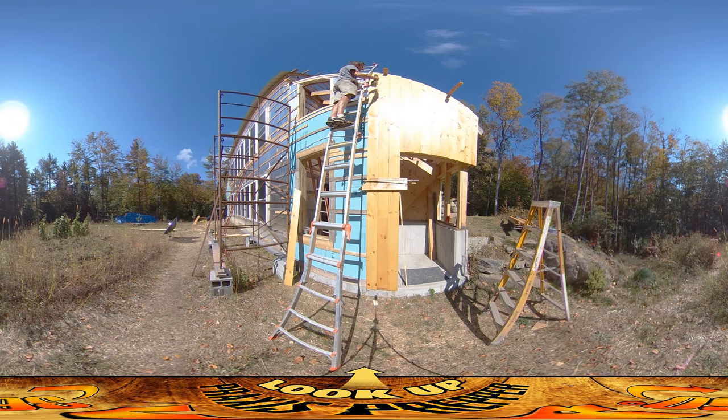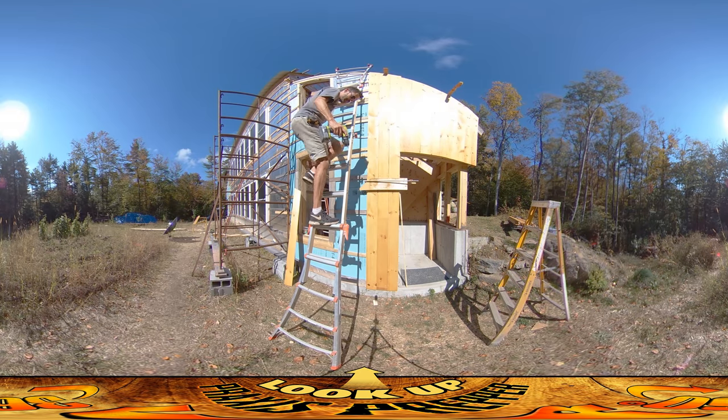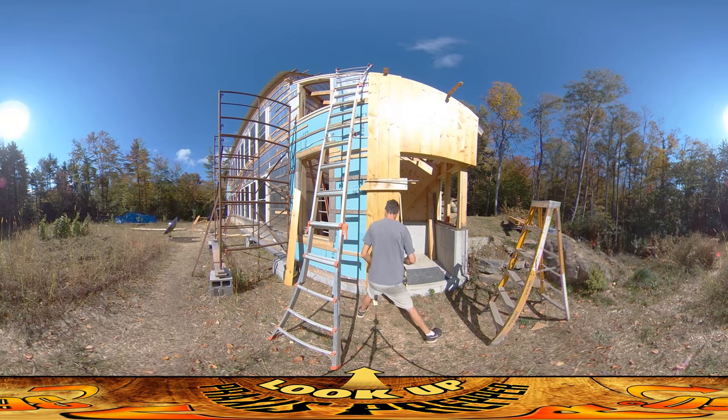As I go across I'm going to have to keep checking plumb to make sure I'm not losing the verticality of the boards. As they have little bumps in them they might start wanting to buckle, and the bottom may end up kicking out more than the top. So I'm going to keep snugging down on this. Down here I might pull this one because there's a little bit of a gap even at the bottom and seat it right here.